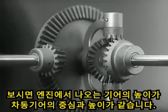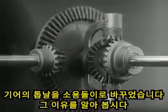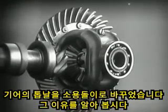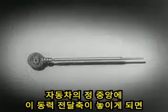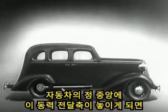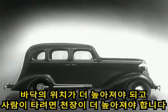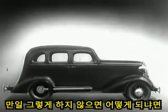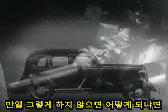Notice that the power is connected to the differential at the center line. We can make our model more compact by moving the gears closer together. When we put our differential in an automobile, we have to leave room for the drive shaft, which carries the power from the engine. We may build the floor of the car above the drive shaft, but if we do, we won't have much room inside unless we make the top of the car high too. Of course we could lower the floor and ceiling, but the drive shaft would be higher than the floor. This would have disadvantages.